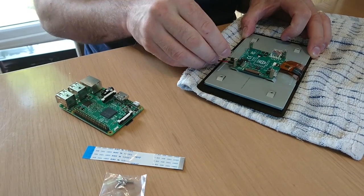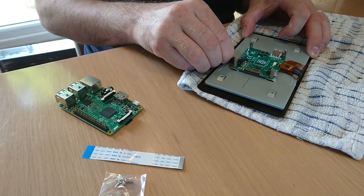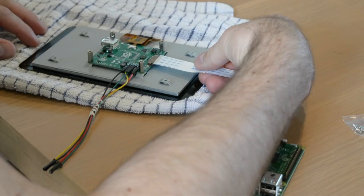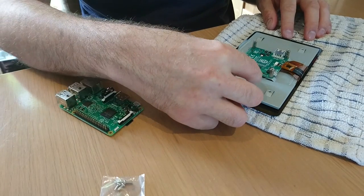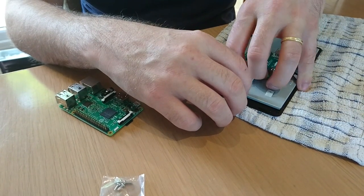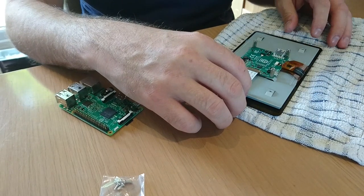This ensures you power the display from the Pi, but you may prefer to simply power it with an additional USB cable. Connecting the ribbon cable, which carries the video signal to the display, is next. This is inserted into the connector blue side down. Ensure that the catch is clicked into place to secure the ribbon.